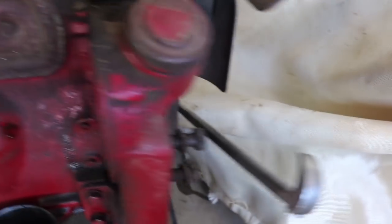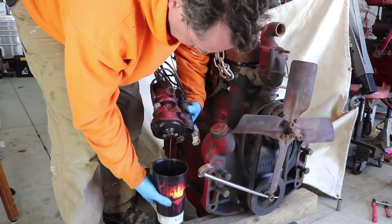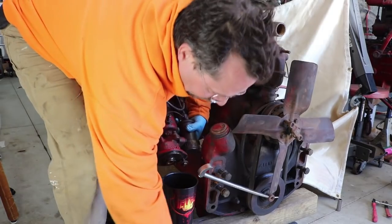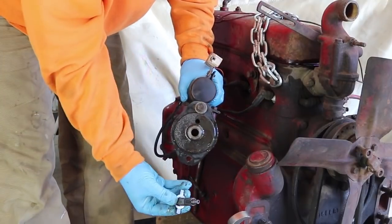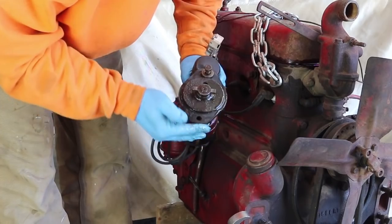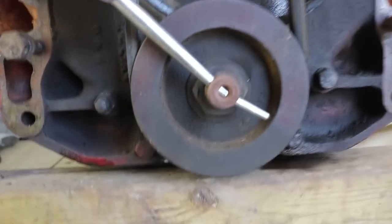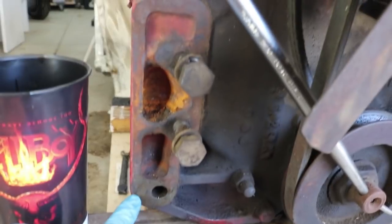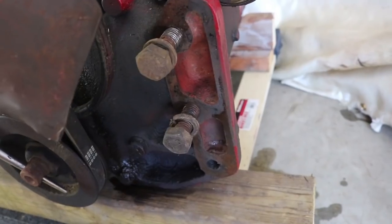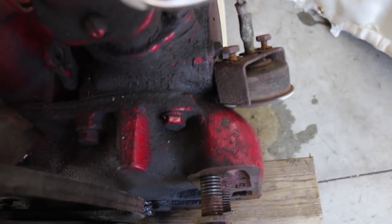The question now is how exactly am I going to count the gear teeth in here? I can only see a few of them. Let me spin the engine and show you what else I'm thinking. I wasn't expecting that to come out — it's just got a brass bushing in there. Slides right out. There's a hole which it looks like just lets the hydraulic fluid through for lubricating this. Looking down here we can see the end of our crankshaft and it's got a belt going up to the fan. Right here is where the radiator is going to be. You'll notice these are the actual bolt mounting points for the front end, and that is actually a separate casting — you can see a seam line right here, so it's not the true engine block itself.